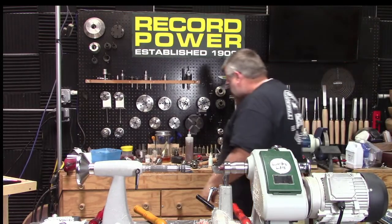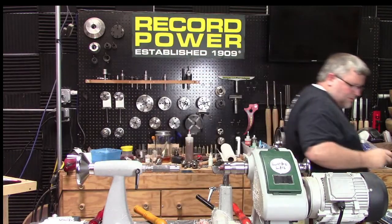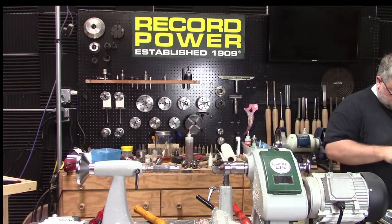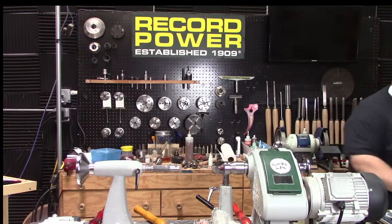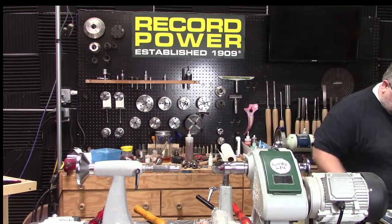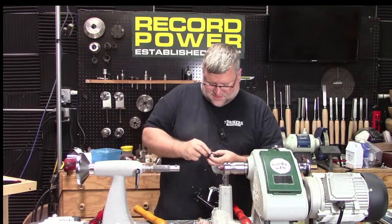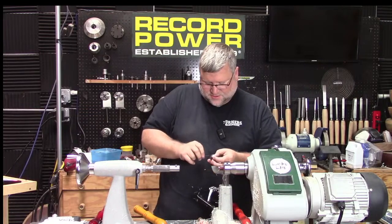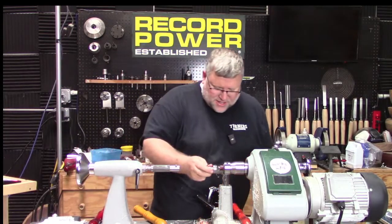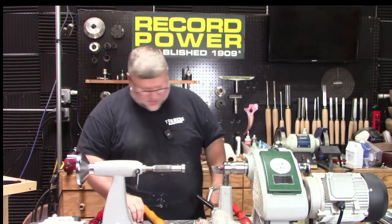Well, there it is. I knew I brought it over. So I'm just taking out the little tap holder to put the die holder in. All right, make sure you use the right die, because if you use the wrong die, it doesn't work nearly as well. We've all done it. I did an M13 cap, and then I did an M14 on the body, and I could not figure out why it wouldn't thread. And I'm like, it's almost like it's stopping. Because it was definitely stopping.